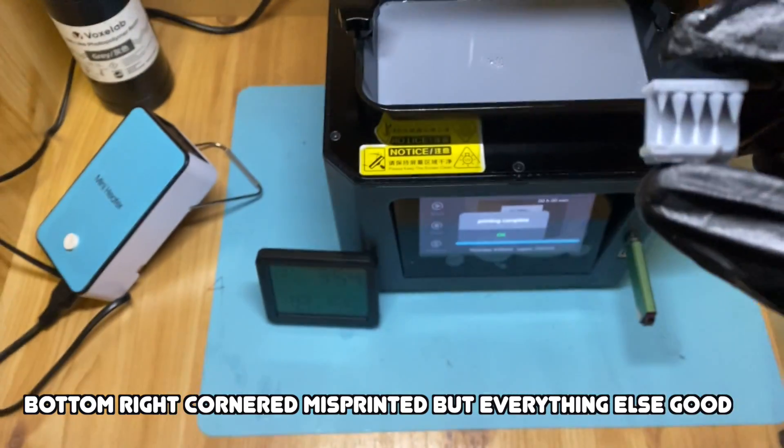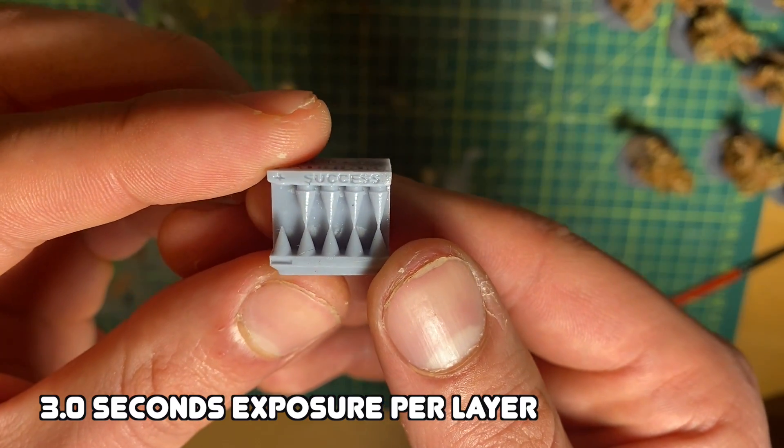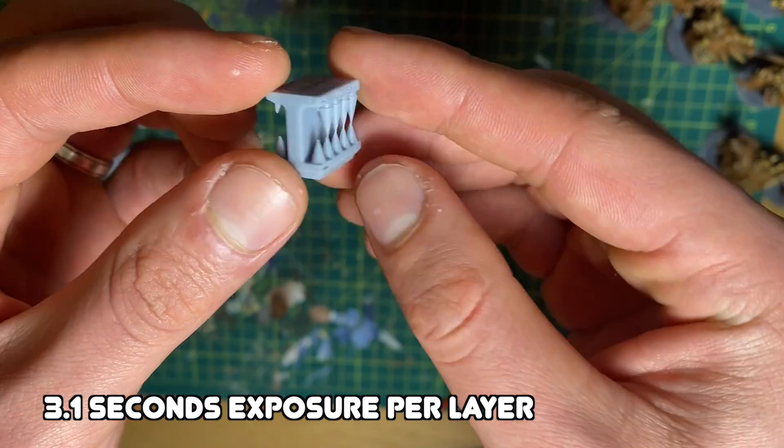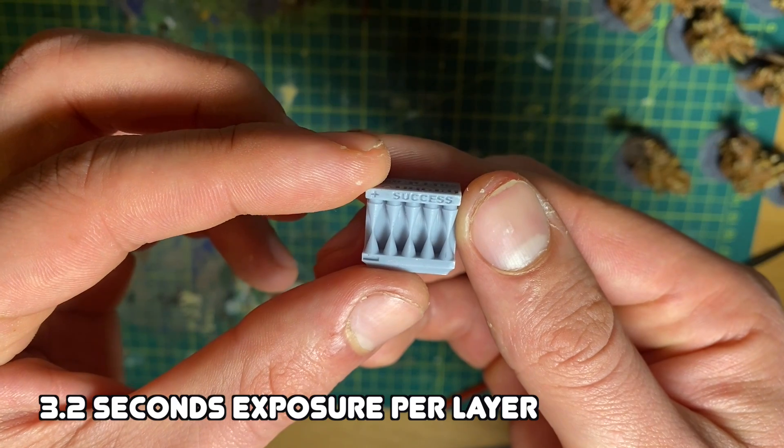There were just a few four-and-a-half cones printing on the success side at 3.3 seconds. Then I tried 3.2, 3.1, and 3.0. The upside with this calibration test is it doesn't use much resin, so it's worth spending the time — it only took about 40 minutes to print, which was pretty quick. Three seconds was too short, but 3.1 and 3.2 were very similar: one was missing a fail cone and one was missing a success cone. That probably means the ideal exposure is around 3.15, somewhere in between. I just went for 3.2 because I'd rather overexpose than underexpose.